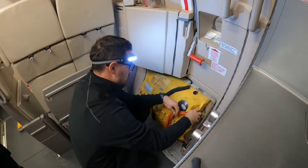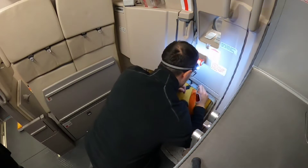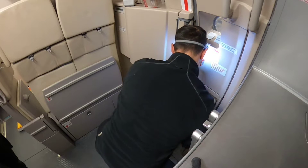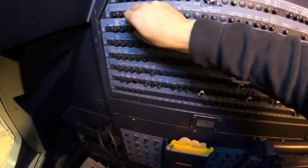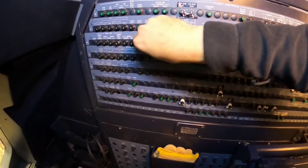Replacement of the slide on the A320 is a bit more complex than, for example, on the Boeing 737, because it has several safety features to prevent unwanted deployment from the inside or outside during normal operation. Now I need to pull CBs. Always follow the AMM because there are so many configurations of the A320 and each of them can have the CBs in a different position.